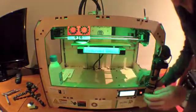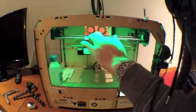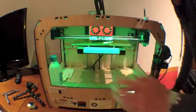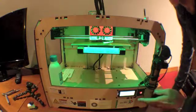In order to calibrate it, I'm using a trusty piece of paper. That feels about right. Now it's going to go to the center — and the center, again, is very snug, about the point of tearing. And we're done.